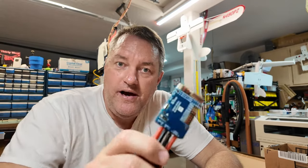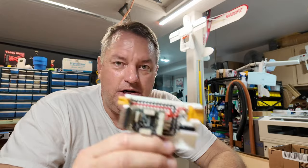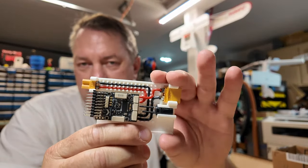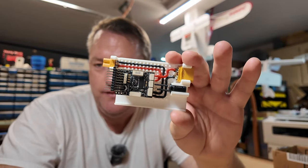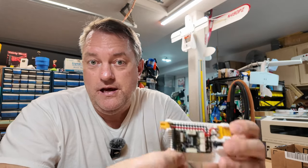It's just something to bear in mind. No harm, no foul — you can mount your flight controllers and just hot glue them into your airplane. But I've been having tremendous luck with this system and I'll continue to evolve it. For the extra weight of a couple of DuPont connectors and XT30 or XT60 connectors, when this airplane crashes I pull this out in one piece. It's rugged, goes together simply, comes apart simply, and I have good RF separation for electromagnetic interference.